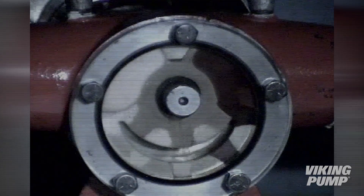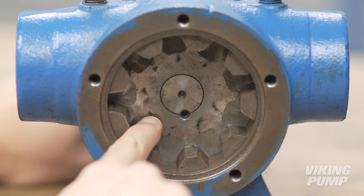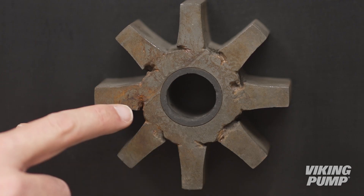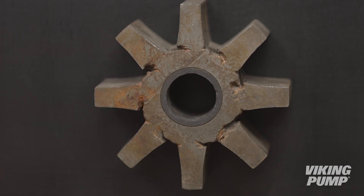The pressures exerted by these collapsing bubbles can be extremely high. The result of frequent cavitation can lead to pitting of the pump internals. For an internal gear pump, this includes the face of the rotor, roots and flanks of the gear teeth on both the rotor and the idler, and at the discharge side of the head. Localized pitting is symptom number three for a cavitating pump.